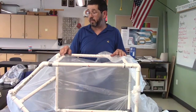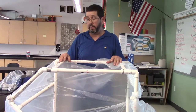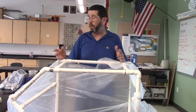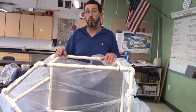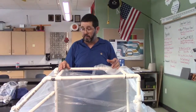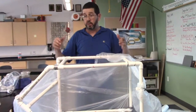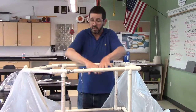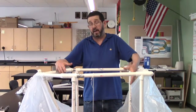Basic buoyancy just says that the volume of your boat has to be greater than the volume of water that your mass is. And one way to think about that is basically your density is about 1. You go in the water and you just barely float, so your density is a little less than the density of water. So when you're figuring out how big your boat has to be, one of the things to think about is, could all 3 people get themselves inside the boat and still be completely inside the boat, like nothing sticking out, because that's your volume, the volume of 3 bodies.